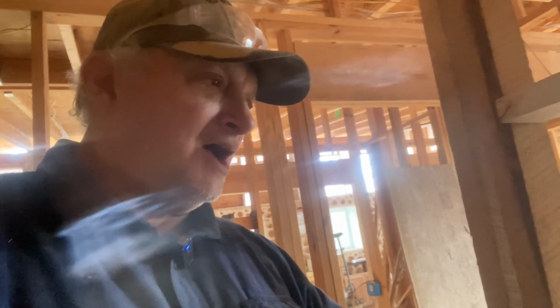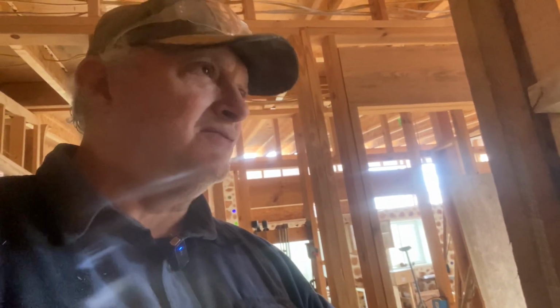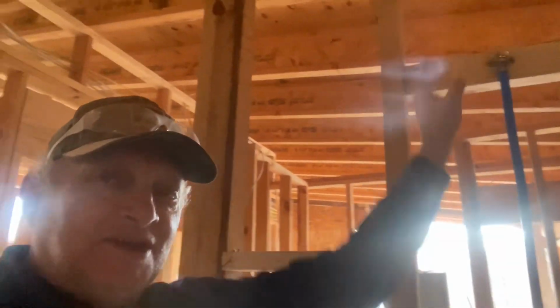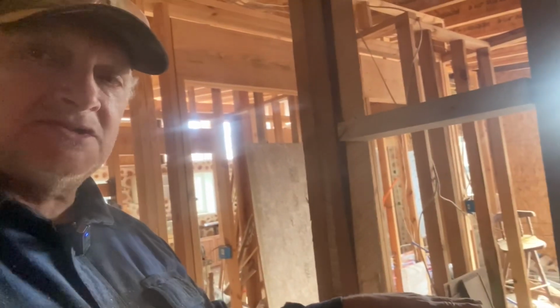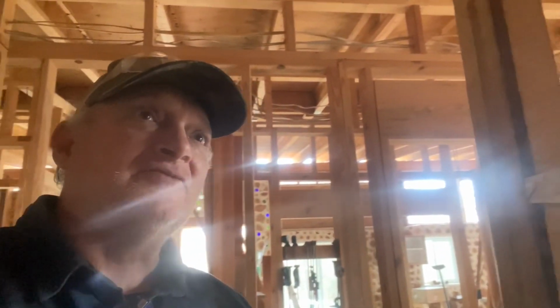And I've got it slanted slightly towards the inside of the shower, so any water that gets on it will be able to drain off instead of sitting there collecting. So we'll tile all that in. I hate those things that hang from your shower bar and they scoot back and forth and all that. And so we've got a his and hers. I guess this one's hers. It's a little bit bigger. Little nooks, built-in shelves to hold all of our toiletries and the like that we need here.